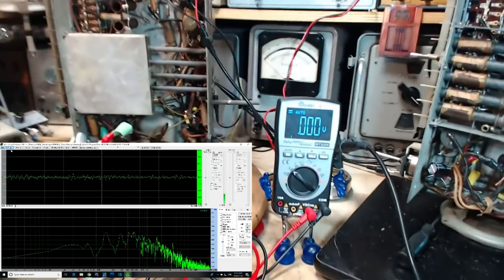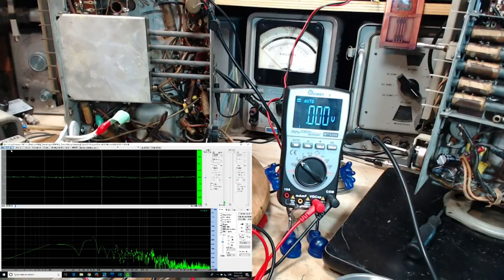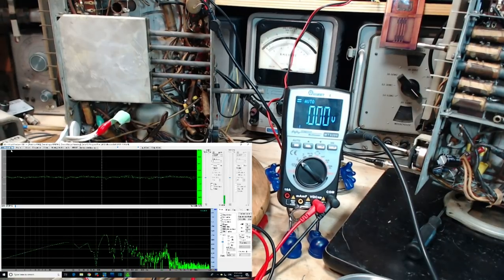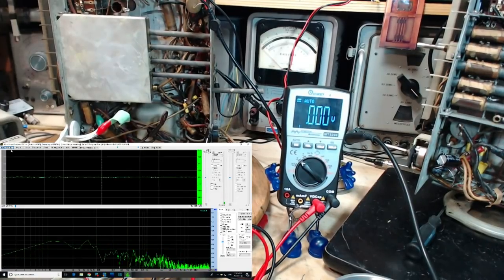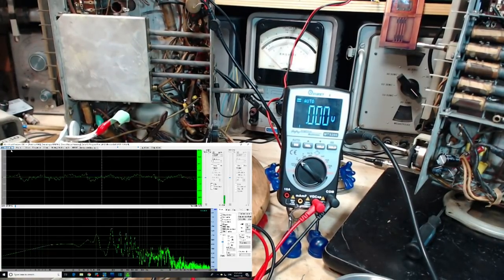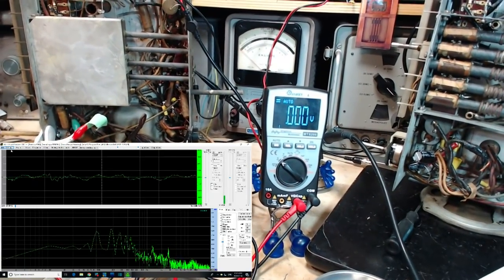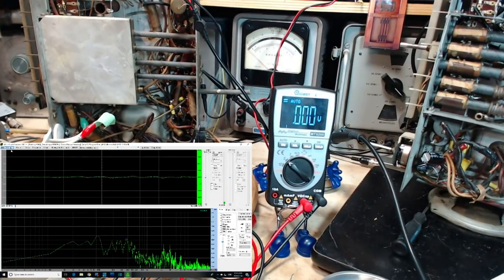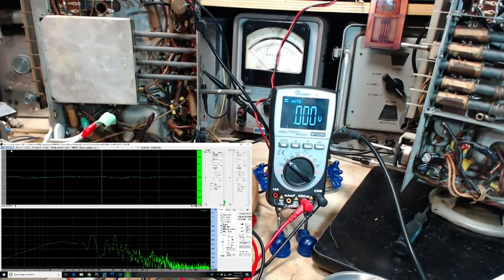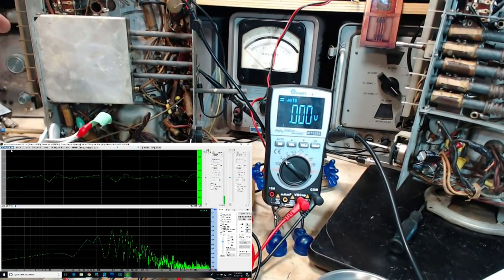So there are a lot of problems with doing this test. We're going to look at how much harmonics there are coming from the signal. I'm going to feed the radio in a moment. And some of those harmonics could be coming in various ways, nothing to do with the radio. So let's not get too hung up on this, but let's see what happened. Because last time there was clearly harmonics of significance, and you could hear them in the sound of the radio too. So, okay, I'm going to tune the signal generator to where the radio is tuned.